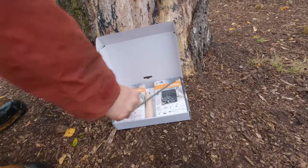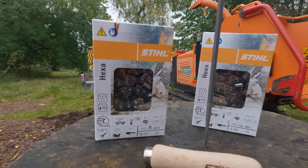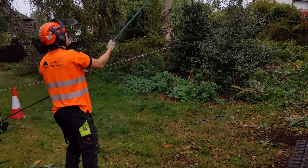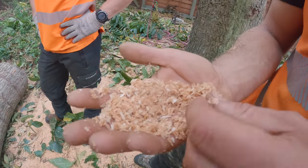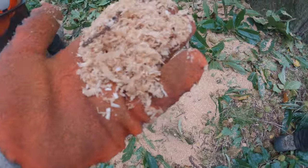If you've seen the first look video I did, our initial impression of the Hexa chain was really good — it picked up really quick and it definitely cut a lot faster than your normal stock chain out of the box. It didn't throw massive chips though; I was expecting it to chuck out a lot more sawdust than it did. But once we sharpened it the first time, we got to a point where I felt it was cutting really well.